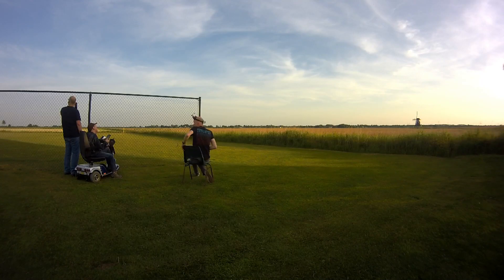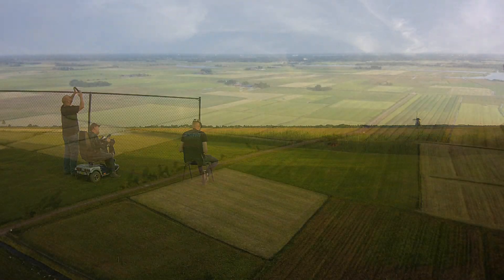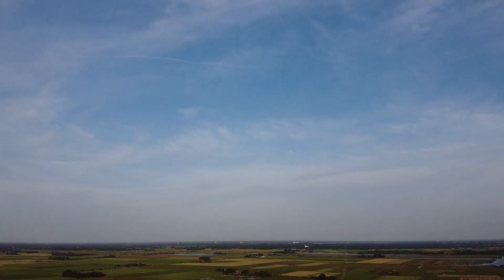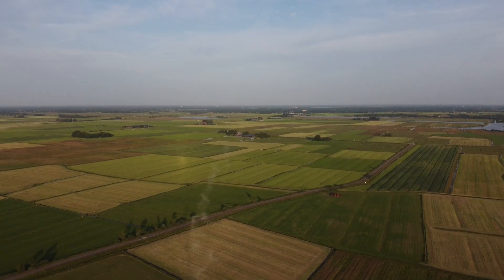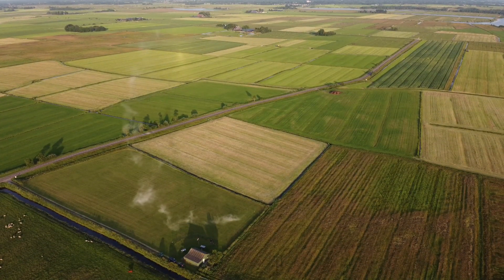So this is the launch. Just checking if there's nothing in the air or in the surroundings, and then off we go. The launch wasn't very stable. I still have some roll issues and also some pitch-over issues, because probably the center of gravity is not exactly in line with the motor. But it was okay. Here you can see our field and the smoke.